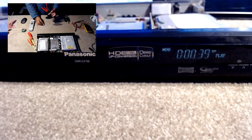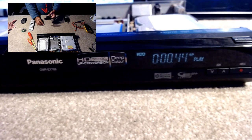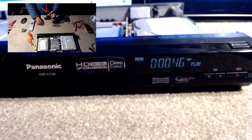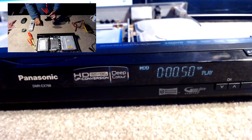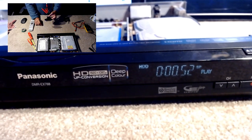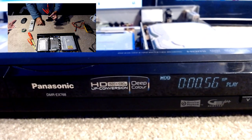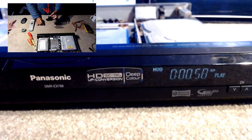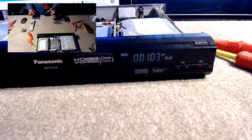even before Freeview, before digital television, as a way to connect a digibox to your SCART socket and extend. You'd set your timer on your machine, leave your digibox on which channel you wanted to record, and the extension link would send a signal through the SCART to turn your digibox on at a certain time. It was a very clever way of recording from a digibox.